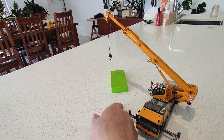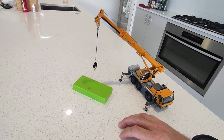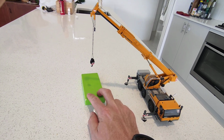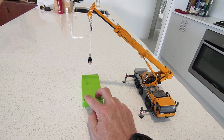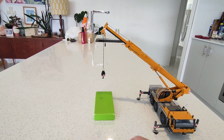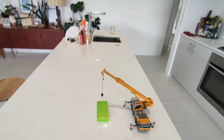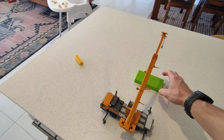Hey mate, what are you doing? A good crane operator will pull you up on that. But just be very wary of this, alright? Always be 90 degrees from the boom. Never centre of load. The trap is when the crane is parallel to the load and centre of slew is centre of the load. That's when both of them line up. And that's when your brain goes, oh yeah, I just stand centre of the load the whole time. Perfect, bros. It's not, alright? 90 degrees from boom, not centre of the load. I hope this makes sense.